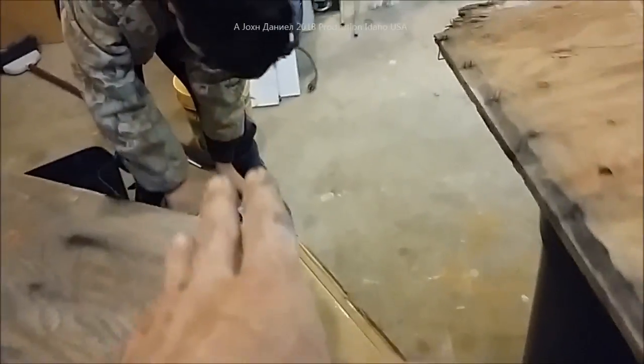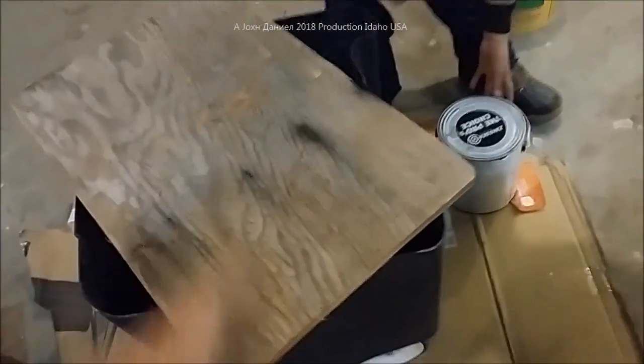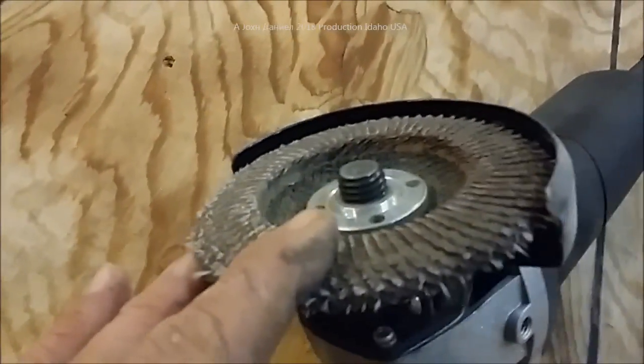Now we're going to be using all-weather, all-surface primer to put on the boards. I've cut the boards and used the grinder — a four-and-a-half inch with 40-grit — to soften up the edges and clean them. This is old plywood, but it's old American-made plywood, three-quarter inch good stuff. Looks rough but it's actually quite solid still. And the half-inch is also American-made plywood — a panel from an RV's bed, very good high-quality 1960s plywood.